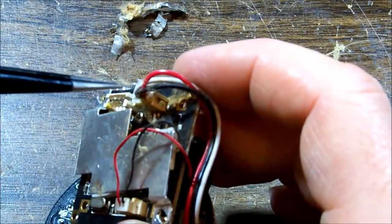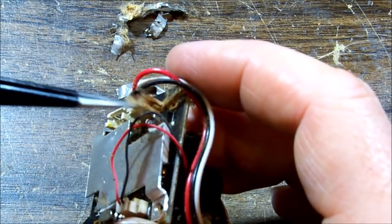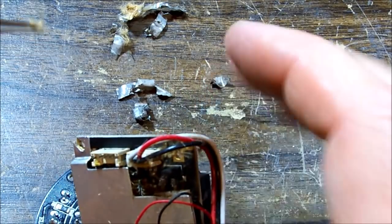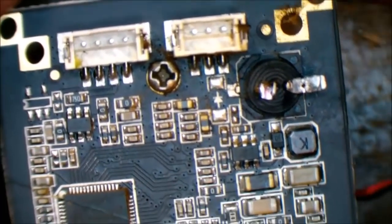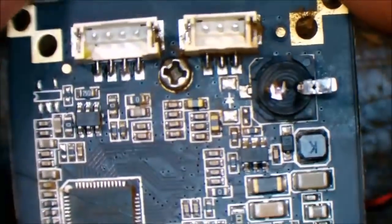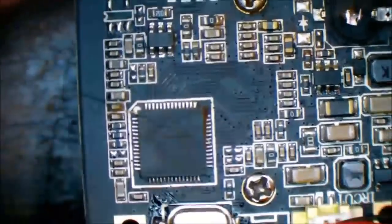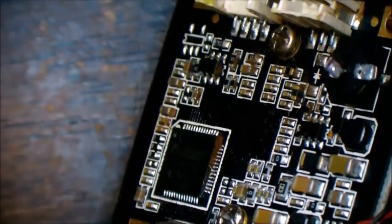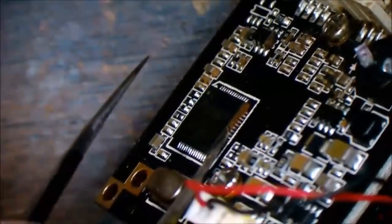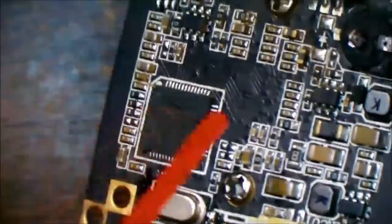For that to happen it was either reverse polarity — or it could have been greatly over-voltage. We need to look more at the circuit and see if it's burnt anything out. It doesn't look too bad in there; luckily none of the electrolyte seems to have corroded anything, it's just awfully furry. It really goes with a bang — it's impregnated itself everywhere in the blast radius. Let's give it a squirt and a brush down and see how it comes up.